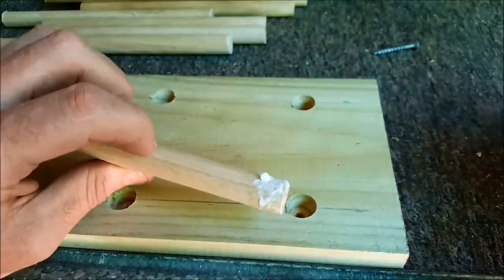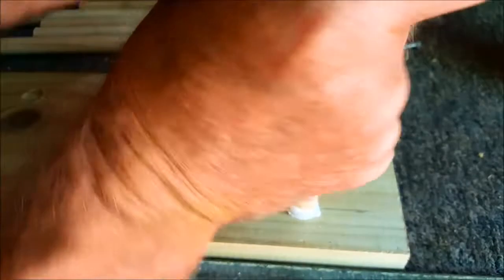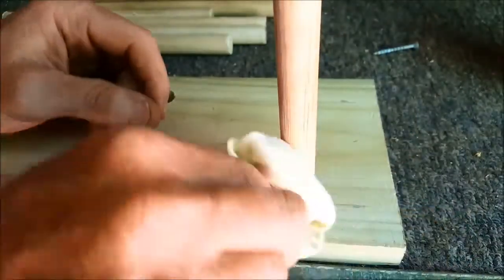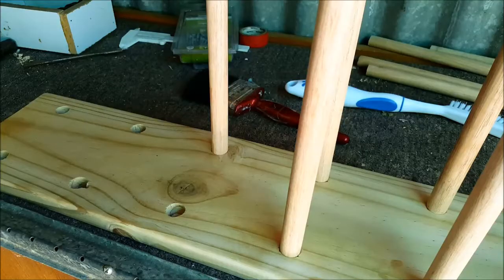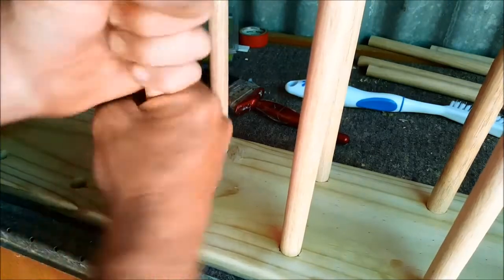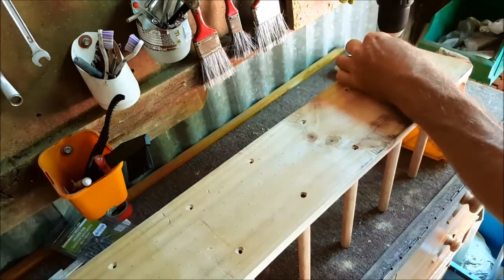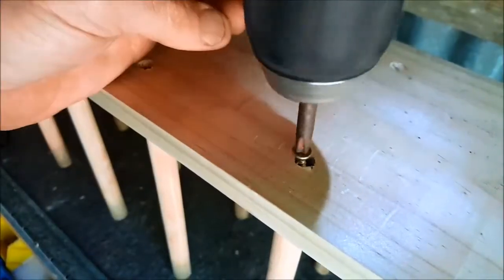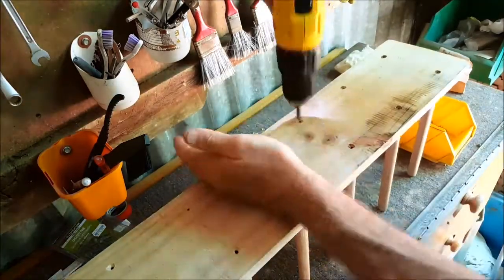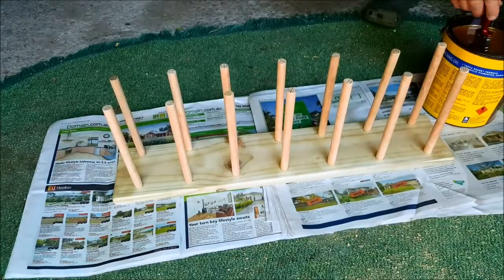Add a little bit of wood glue — you don't have to do this because the dowels aren't holding a great weight; a water bottle doesn't weigh much. But if you glue them all in quickly enough, you can straighten them all up so they look nice and even, and they won't move. Now put in the countersunk screws. And structurally, that's it.